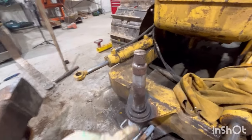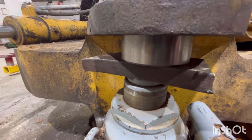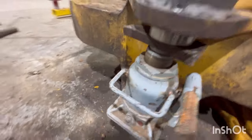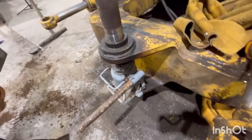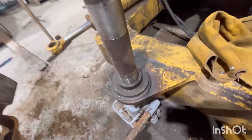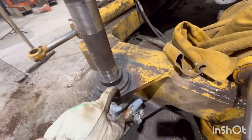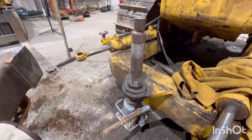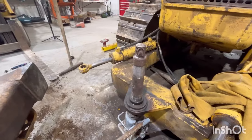Let me show you what I've got going here. I have my old pin lining up an old bushing and a new bushing, a piece of half-inch bar stock on a jack. I'm not sure how many ton this little guy is - it's mostly the height that makes it fit in there. I use this to push the new bushing into the bottom, and now I'm using it to put that one in the top. Get some pressure on it, give it a tap - that vibrates the whole deal and made it jump up into place. Do that, get the last bushing in, weld the washer back on this pin, then we're ready to reassemble some of this stuff.